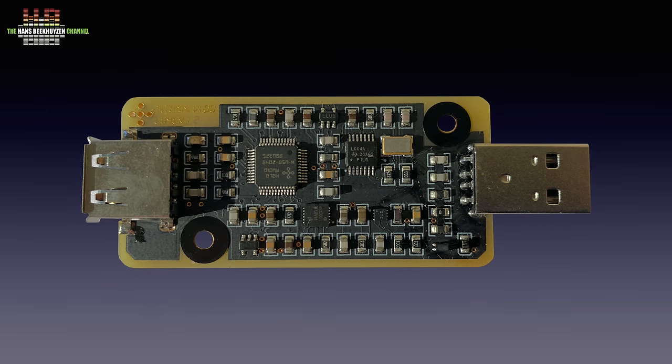Where passive components are mostly used for filtering, here we find four chips and two voltage regulators. Documentation couldn't be found for three of the four chips. There is one Holo Audio chip closest to the output — likely an interface chip. The second can convert 3.3V signals to 5V and back. Next to it is the clock crystal, and there are two voltage regulators: one for the data channel and one for the 5V USB power line.